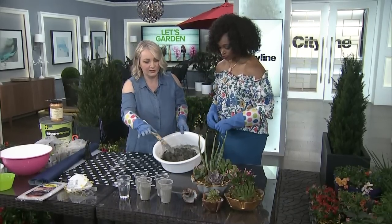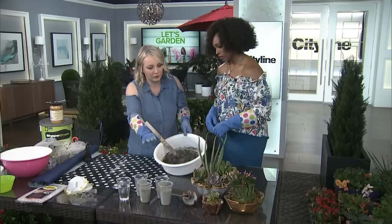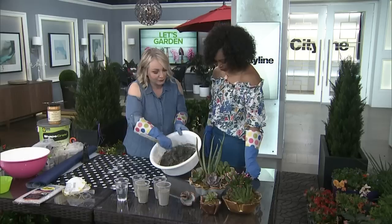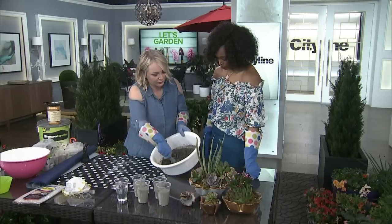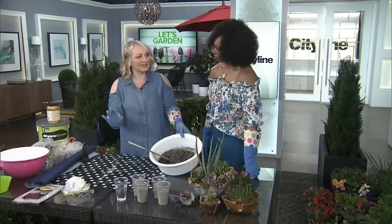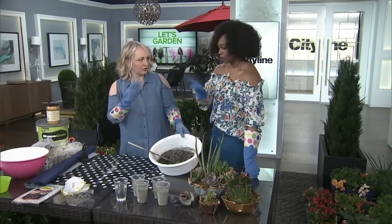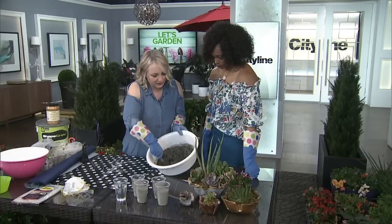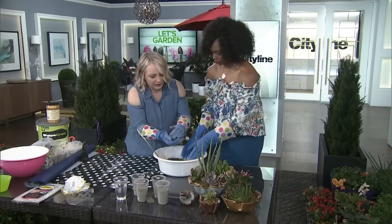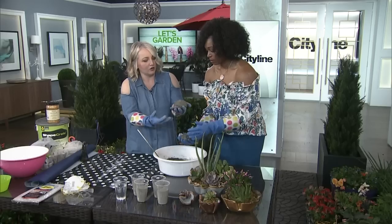The ratio that I've already mixed is four parts ShapeCrete to one part water. You don't even have to necessarily measure — just however much you put in, four parts ShapeCrete to one part water. When you're mixing from the dry formation, start with a little bit of wet in the bottom of your pot first, then add in a little bit of the dry — it's back and forth, back and forth. Wear a mask and glasses when you're working with the loose concrete fiber; that dust will come right out. But since it's all nice and wet now, I've got the mask and glasses off. The goal when mixing is you want to do a ball test — you want to be able to shape it into a ball and it can slightly sag, but you don't want it running through your fingers.